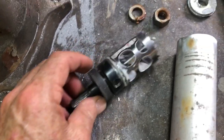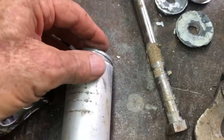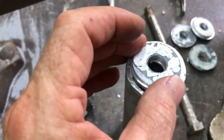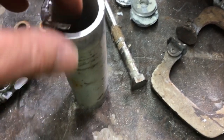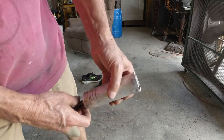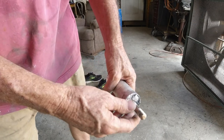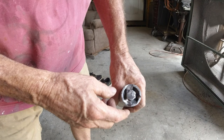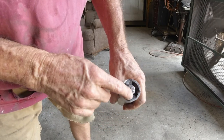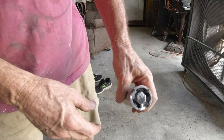I happened to have the right size, and then I drilled a half-inch hole in the middle for these long bolts. The pieces sort of fit inside the tubes — they fit perfectly except for a little flange that broke off rather than drilled, so I'll do a little cleaning up and weld them in. I took one of the plate washers I made and welded it in one end, sanded it flush, then welded one in the other end recessed the same thickness as the bolt head. I couldn't weld the stainless to the aluminum, but I could put enough melted aluminum around it so it can't turn — so this is my standoff, and I can put a nut on this side without worrying about the bolt turning.